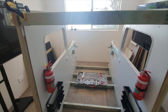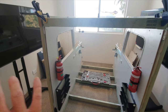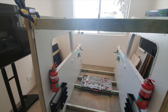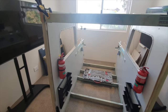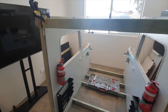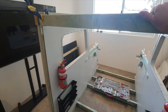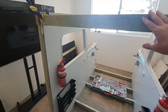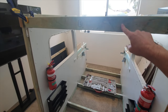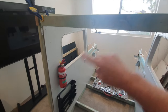I've just moved it in this morning and I'm now assembling the base frame once again — all clamped up. I'll stay in metric since that's what we use here in Australia, so you can do your own imperial conversions. The main timber frame itself is just treated pine because it's relatively light and easy to work, and I've used 70 millimeters by 35 millimeters throughout the entire frame.